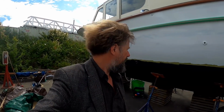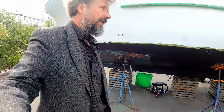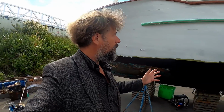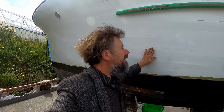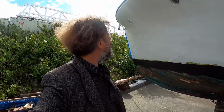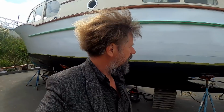So today is more of the same, pretty much. Going to finish caulking the garboard, and because I have to get it paid, and this is where I come clean, I'm going to pay it again with Sikaflex 291. Yes, I am. Other than that, we'll get another coat of topside paint on as soon as this is dry enough that we can just put a keying bit of sanding on it, and that'll look great. I'm actually really pleased with the way the topsides look. Other than that, I think we're in really good shape. Let's get going.